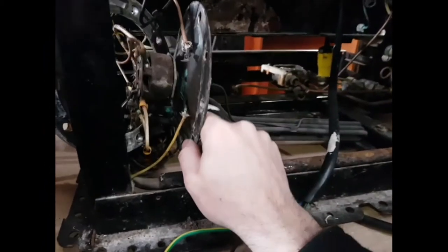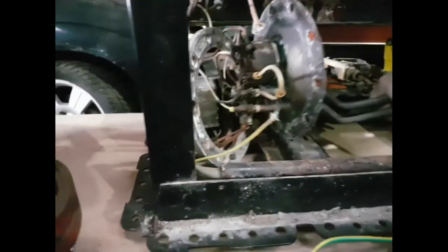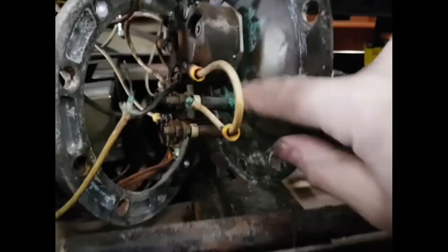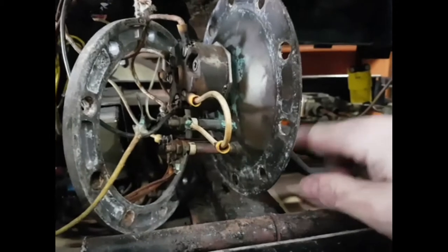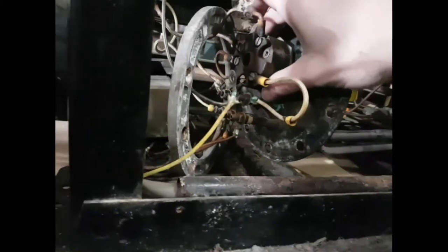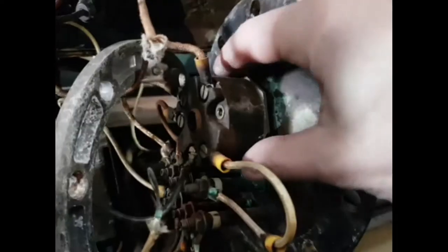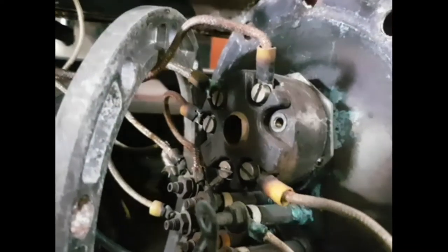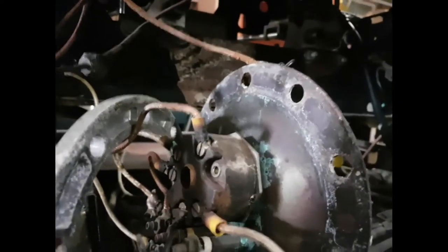Here it is. The one that I am most interested in is the original heating element, which is integral with the boiler end cap. You can see there's no separate flange for the element — the element legs go right through the boiler end cap here. The real reason I did not use this in the current project is because we've got a pretty obscure-looking high limit thermostat here and it just turned itself to dust. There used to be an auto-reset button here that just fell out. What we're really trying to do is create a machine that's going to be fun to play around with, and there's nothing fun about reusing this — it's just going to cause nothing but problems.